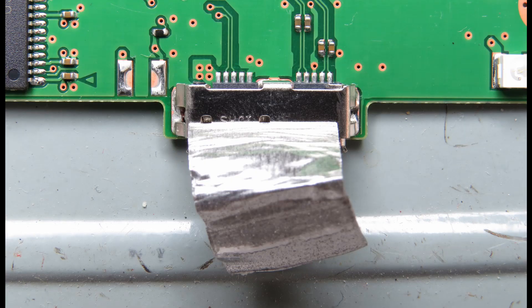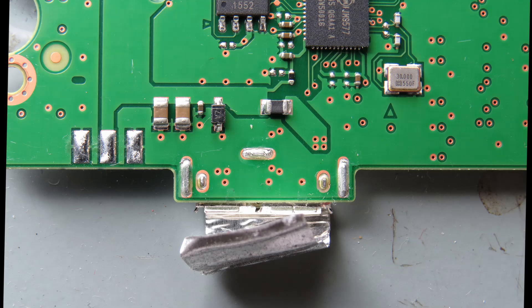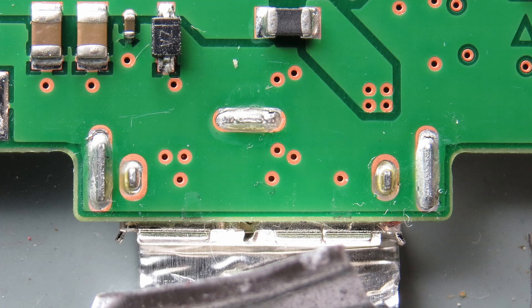The first thing I did was take some close-up photos of the board. I noticed around the connector that there were some cracks on the big solder joints. Let me zoom in on the photo — you can see one on the right hand side that's cracked, and also the one in the center has cracked on the outside of the joint. The one on the left hand side doesn't look that bad, but since I'm going to have to get a soldering iron out to fix the other two, I might as well re-solder all the big joints that are part of this connector.